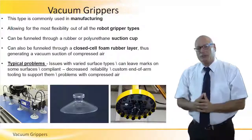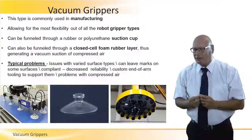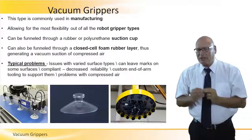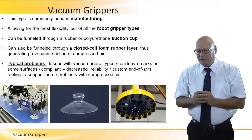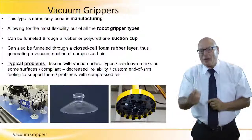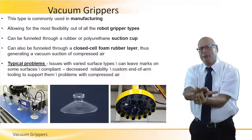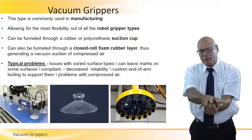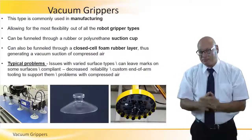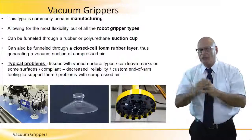It's basically for manufacturing and is very flexible. However, there are some problems with vacuum grippers that limit their applications. They can leave marks on some surfaces because of the high vacuum pressure between the cup and the body. When released, a mark is sometimes visible, especially on sensitive objects, so reliability is decreased.